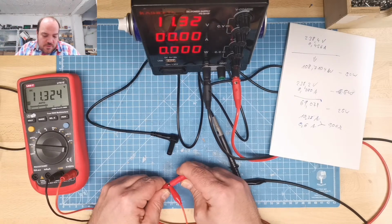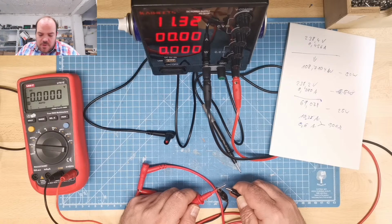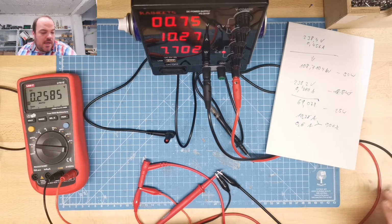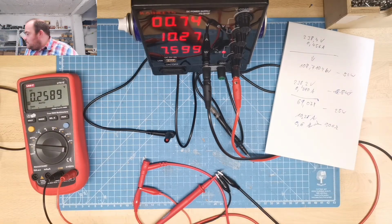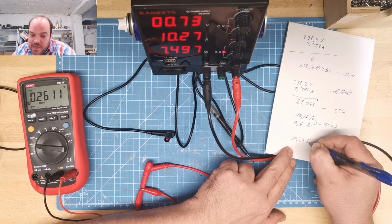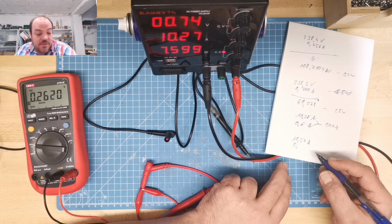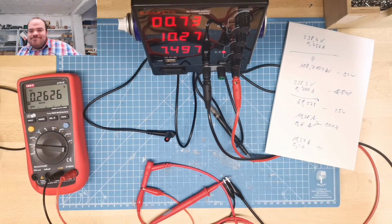We just make the short circuit with the Unity cable. We should get lower results. Okay, now I hope you can see. I know this video gets messy, too much information. With the cable from the Unity meter, my best meter, we still have the 10.27 amps, but the voltage drop over this cable is no longer 600 millivolt. It's only 262.